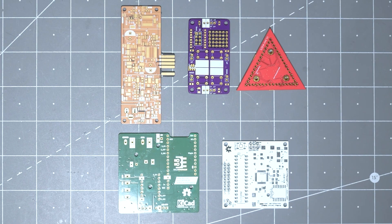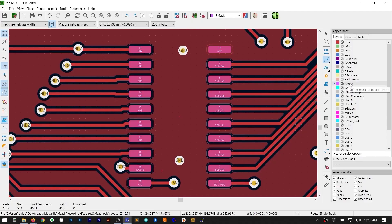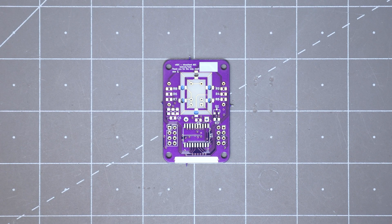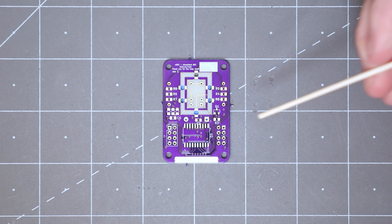The paint or color you see on a board is called solder mask. Typically, PCB software assumes you want the solder mask everywhere except for pads where solder goes. So, when drawing on the mask layer, it is a negative, meaning solder mask will not appear there. For example, on this board, this area uses multiple polygons to expose the substrate and the copper traces.